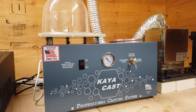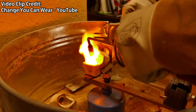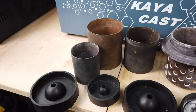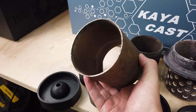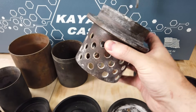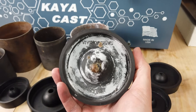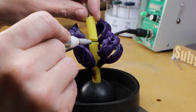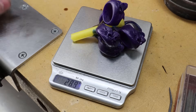When it comes to the actual casting process, I'm going to be using a vacuum casting setup. There's also a centrifugal force setup that comes in a little cheaper — I've never used one, but they do work and I've seen great results. For the vacuum casting setup, you have options for different types of flasks: solid ones, which are cheaper, or perforated ones that cost a bit more but get better vacuum through the entire mold. Regardless of which you use, you'll use a rubber bottom to hold your sprue and fill it with investment. I'm going to cut down some of the extra sprue and take this over to weigh it so we can figure out how much metal I need.